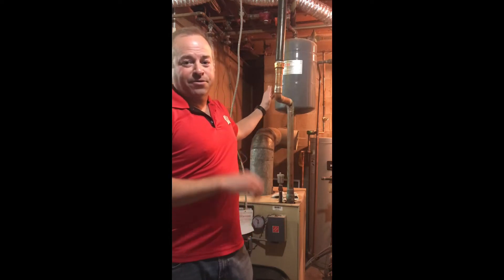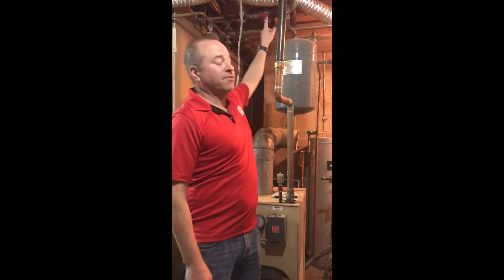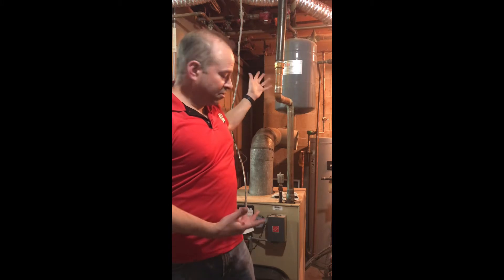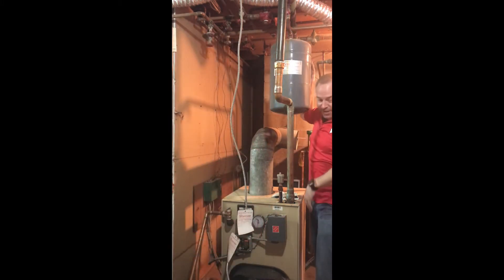I've turned off the power, I've turned off the water supply, and I've closed off the valve up here. I've got as much water out of here as I can. I think it might still be heavy, but I'm going to unscrew it — hopefully that doesn't come crashing down on me. I'm going to loosen the tank with a wrench first.